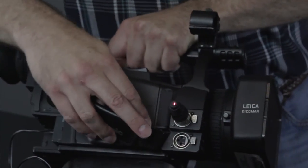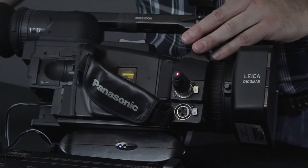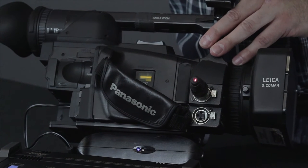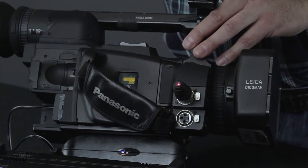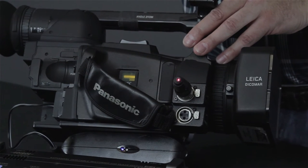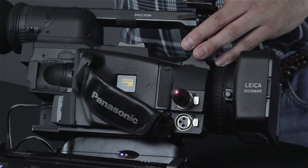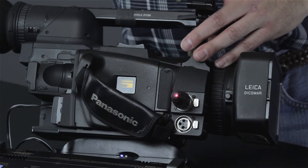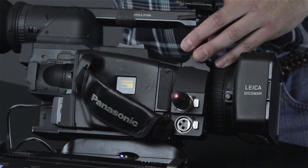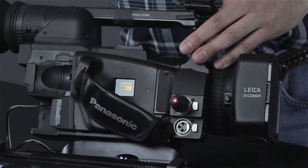The last device is an actual camera. We have the inputs we talked about with cables — plug in here. If I'm coming out of a mixer, I would come out at line level. There's mic level and line level to deal with. Mic level is from a microphone — it's a very soft signal, so we use a preamp to raise it up to line level. Line level is already a very loud signal — the loudest we deal with. If you plug a microphone in with it set to line level, you won't hear the microphone. Vice versa, if you plug a line-level signal into a mic input, it's going to blow out and be over-modulated — it sounds terrible. You'll know right away something isn't right.